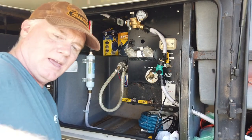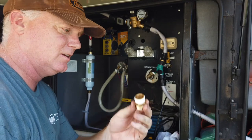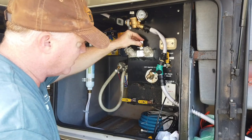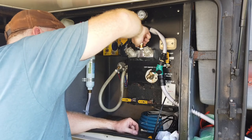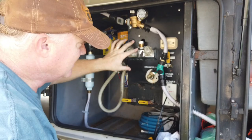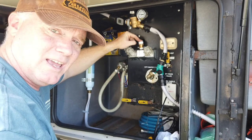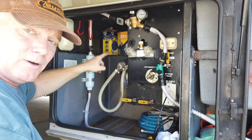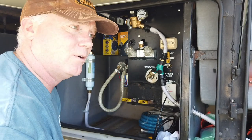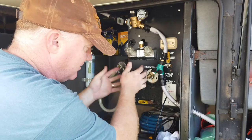While we're here I'm going to do one final thing - add this adapter. You can get this at Lowe's, I'll put the link in the description. It has an internal pipe thread and I'm going to put it right over the outlet on the sink. I've taken the spigot to the sink off and what this does is change the threads from the faucet thread to a garden hose thread. So I can come off of this with my Zero-G water hose and set up a warm shower outside or a place to wash hands - it expands the use of the bay because nobody's going to get in here to wash their hands with all this stuff around.